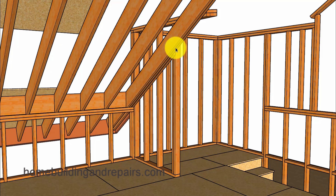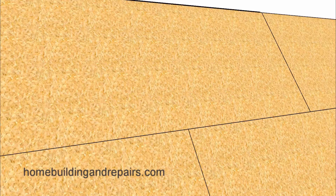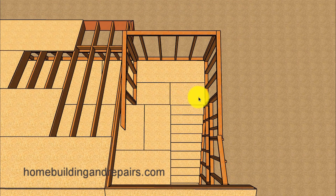I'm also going to need a double roof rafter to support the valley rafter, and then another board here to nail to the wall framing, which will provide additional structural support for the roof sheathing. The width of this area is usually going to be determined by your building codes. In our example, I made it a little bit larger than 6 feet because most building codes require a 36-inch by 36-inch minimum for a landing area. Even though this direction is about 4 feet, this direction here is about 6 feet 4 inches.